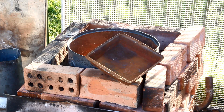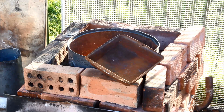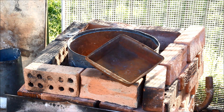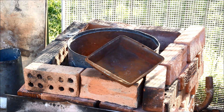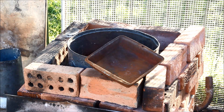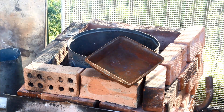Now, as morally offensive as I normally find safety tips, here's a real one. If you're going to pour molten aluminium into anything, make sure it has no moisture — absolutely none. If it has, it can cause a steam explosion and that will really give you a bad day. One way of doing it is just heating it up like this, turning it around a bit more and driving off all the moisture. Once you know it's properly dry, then you can pour the aluminium into it without having to go on like a safety sissy.